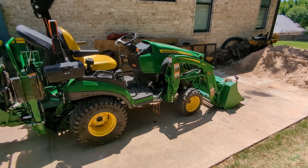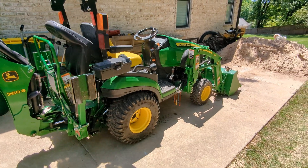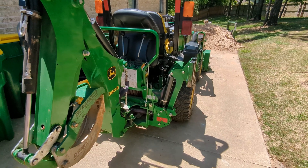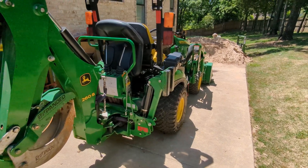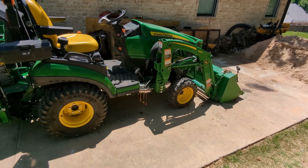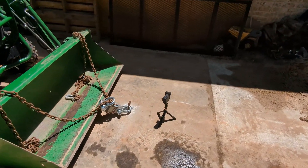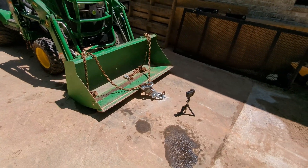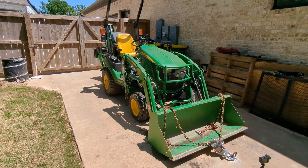This tractor does have Hydros Plus and a slightly larger pump than is available today, but from a pressure perspective, speed's not what we're going for here — it's all about pressure, so should be no problem. That could contribute a little bit to the disparity in PSI between 2500 and 3400, because that additional flow, while in theory shouldn't matter, you can have a little bit of variance there with more flow. We know what the actual values are. I'm going to change out those lift cylinders to the 2 inch. If that was 900 at 2100, I would expect somewhere in the 1500 PSI range — I'll go ahead and do that math.